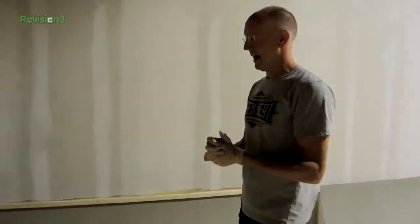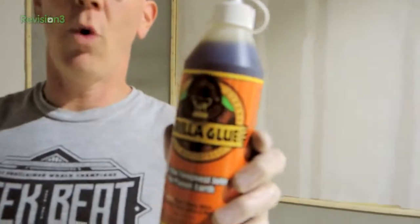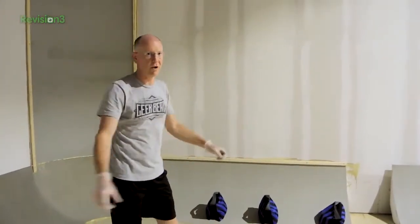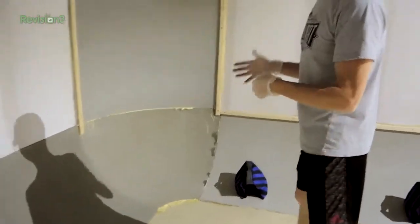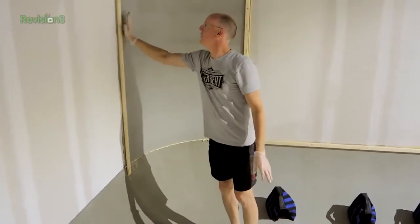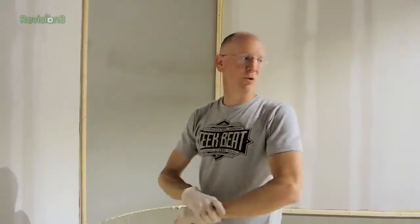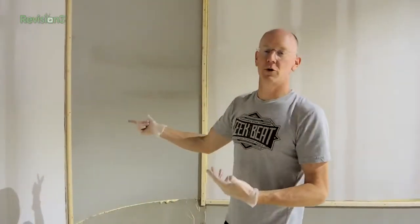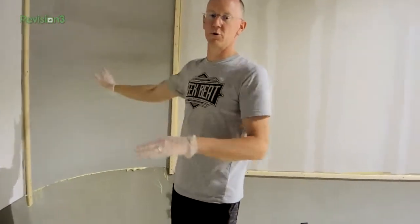We're going to position them and we're using a really heavy-duty industrial glue — Gorilla Glue — which is activated by water, so you're going to see us use a bunch of water in this process. The ones in the middle have already been done so you can see a nearly finished product. We put the Gorilla Glue behind them and then use furring strips, screwing right through the material to hold it in place while the glue dries. You might think, why put screws through your expensive materials? We're looking at about ten thousand dollars worth of material here. Well, you don't care about the screws because once all the pieces are in place, it's going to be filled, taped, and embedded like drywall to cover the seams. When it's dry we'll remove the strips and fill in the holes — no big deal.